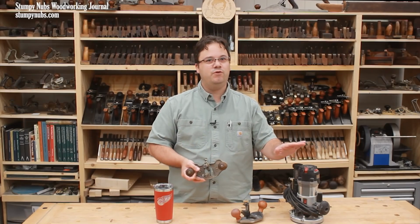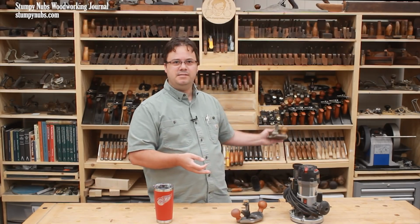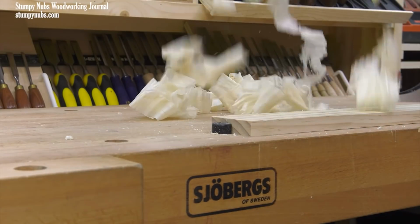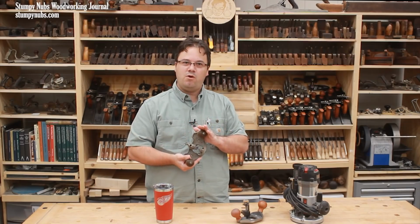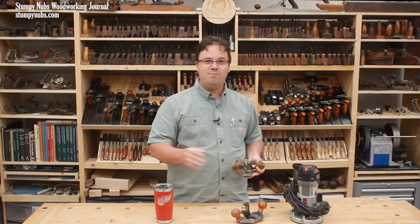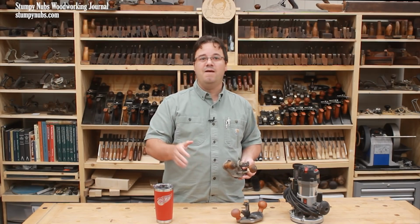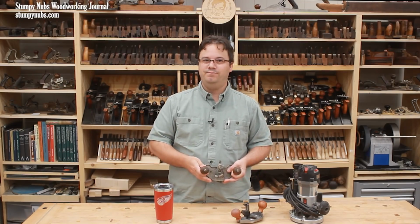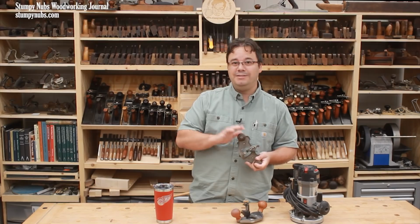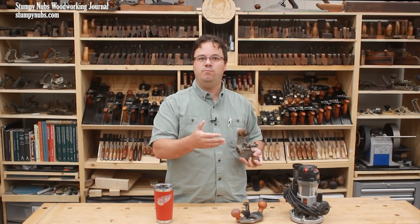This is not a manual version of this. Neither is it another in a long line of surfacing planes that must be fiddled with to get those wispy thin shavings that are so popular among today's woodworkers. Think of a router plane as a tricked out chisel. You use chisels, right? Even if you plug most everything else in, you still occasionally pull out a chisel to do some tasks that power tools just can't do as well. That's what a router plane is. It's a precise, micro-adjustable, depth-controlled chisel that can be the perfect complement to your big, powerful machines.